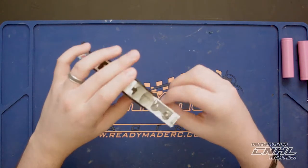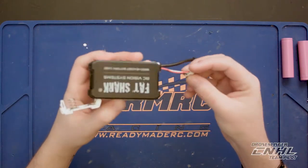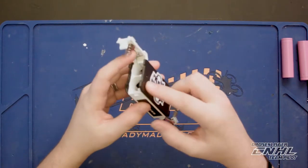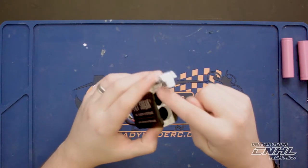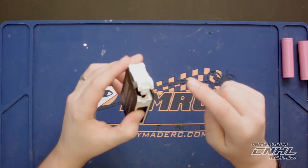I've got it soldered right here on this little plate. If you wanted to do it really quickly, you could just route a wire from this middle part out on the outside of your case, tape it on the outside, and then just solder it to this little plate here — that will give you your second cell and make your charger recognize your second cell.